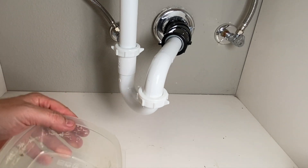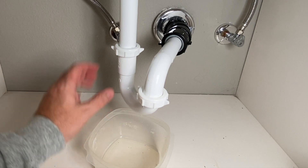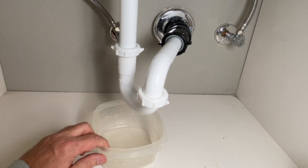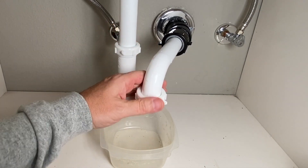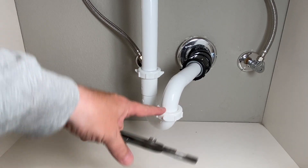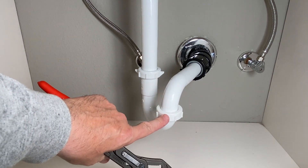So you want to come down underneath your sink and locate your P-trap. This is that U-shaped bend. This is actually going to house what you're looking for. Get a container to catch some water because there's going to be some. Pop that off, pop that off. You may need a pair of pliers to undo these nuts — I'll put a link in the description box below — but a lot of times they're just hand tight.